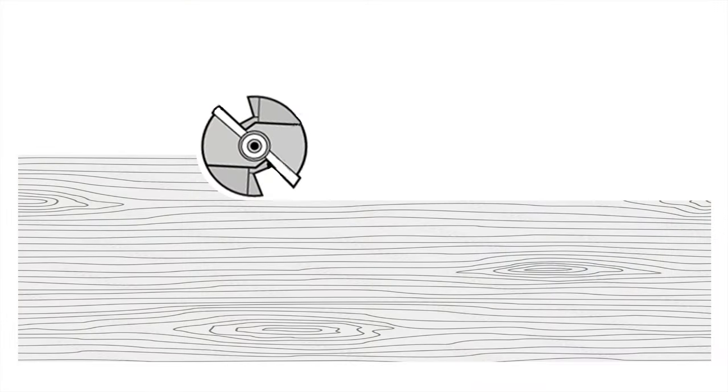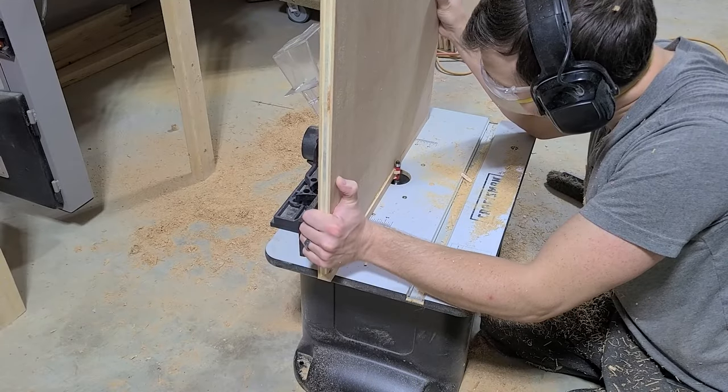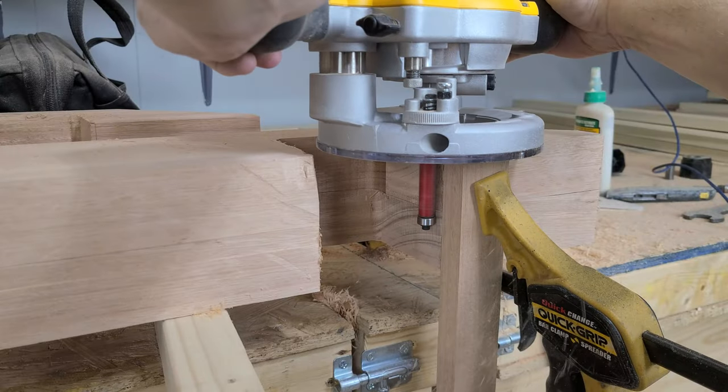Now let's talk about when to break the rules. If you are routing along the edge of a piece, there's a possibility that the blade's teeth will catch the wood fibers and split them instead of shearing them — especially with larger passes or wood prone to splitting like alder. If the wood catches, the energy will cause the router to kick back. This can be prevented by climb cutting, meaning you allow the router to go in the direction it wants to. You have to have a firm grip and resist the pull, but because you're now going the opposite direction, the teeth shear the grain and scoop it out, which can save your piece.